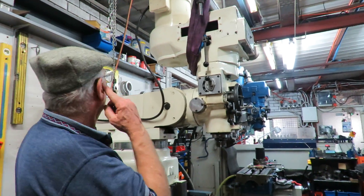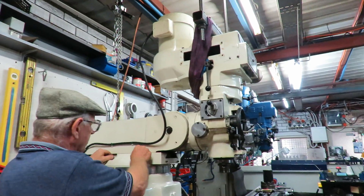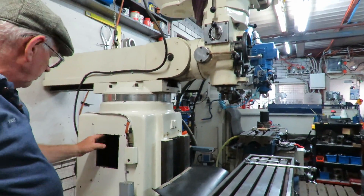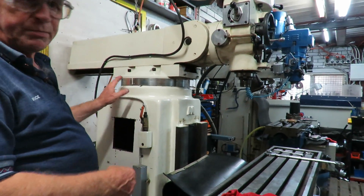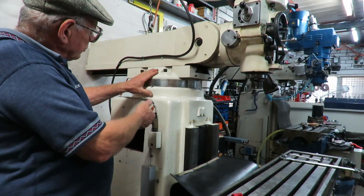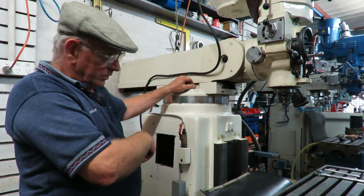So without further ado, I'm going to tension everything up and we'll see if we can break this bond and release the bolts off a bit more. I've also meant to mention that I cut a window in here in order to be able to get inside to the spider, to line up the spider. There's a spider in here that clamps through these bolts — it clamps the two parts together. Once this is positioned, we'll need to make some longer bolts to fit it.